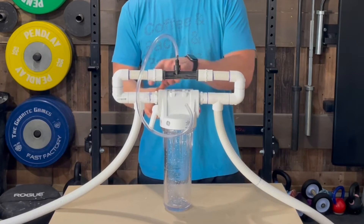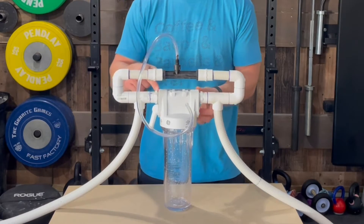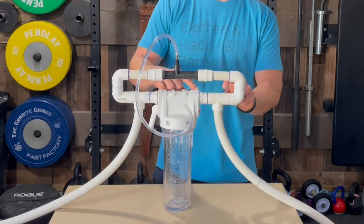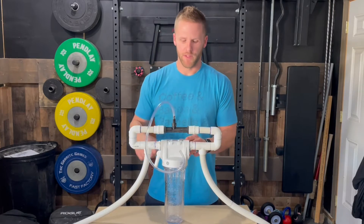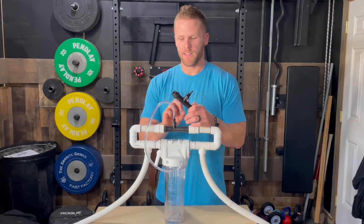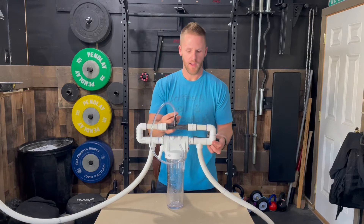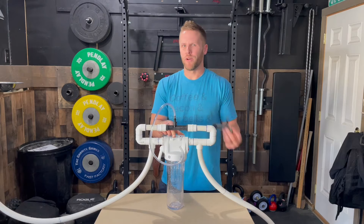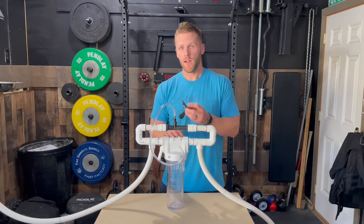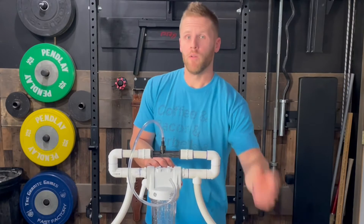What that means is instead of branching off, the water would come in one side, flow through the filter, have the venturi there, and return to the tub. The reason not to do that is you have a very small hole for the water to go through, so if the water purely came through the filtration system into the venturi and out the other side, it would greatly reduce the flow of water through your system and make your pump work a lot harder, which you don't want.